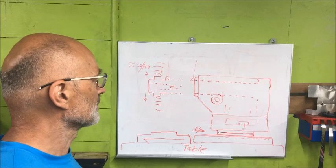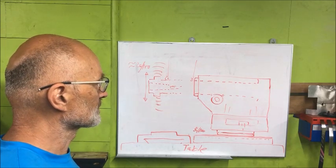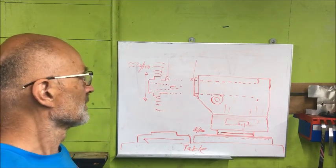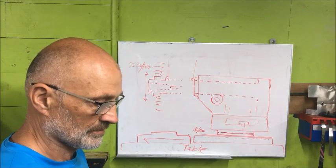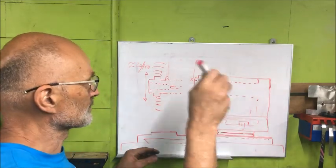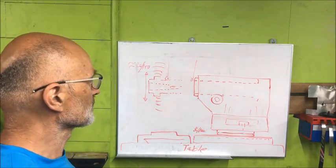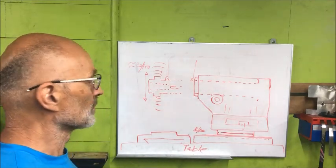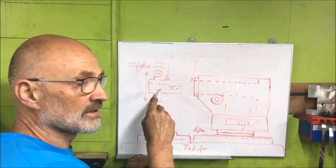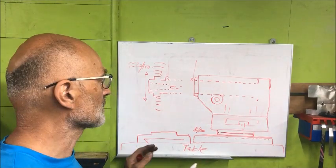The bore is quite sloppy — when extended I can move the spindle 20 hundredths minimum, probably even more, which is not good. This will present itself as an out-of-round bore if you think about that — not precisely in line, and you're not guaranteed a good result. When milling, of course you wouldn't mill with the quill extended like this anyway, but this would be, I guess, unacceptable because it would chatter. It's not good — you're milling with the spindle in here, of course, also locked down.